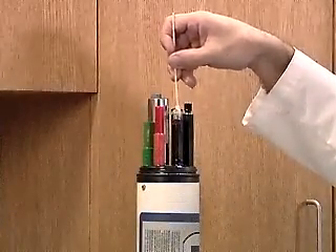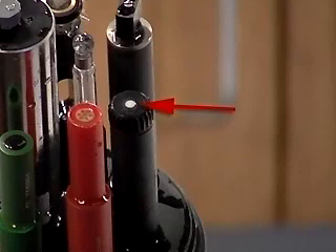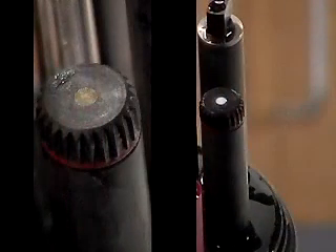The sensor should be cleaned with a cotton swab or soft brush and soapy water. The reference junction is a threaded cap with a sleeve of porous Teflon in the center. The Teflon allows the reference electrolyte to make an electrical connection to the sample water while preventing them from mixing freely. If it becomes clogged or dirty, replace it.